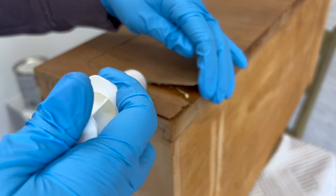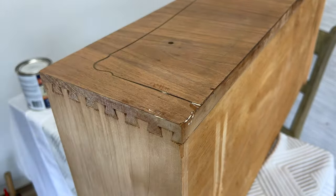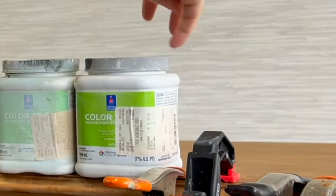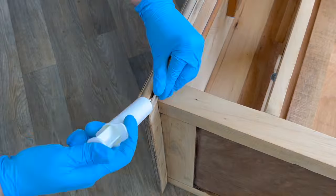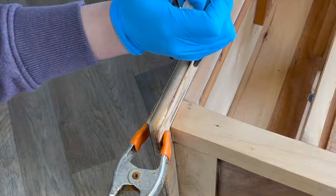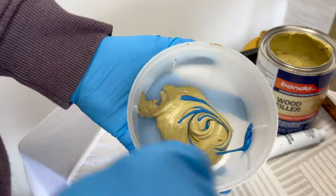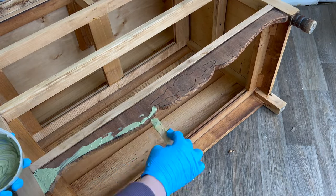There were a few other spots that were in need of gluing, and so I did those after the top veneer glue dried. Time to fill in all those little veneer chips on the bottom trim piece. I mixed up some Bondo filler and applied it to the bottom with a wood stick. Once that dried, I sanded that all back smooth very carefully.